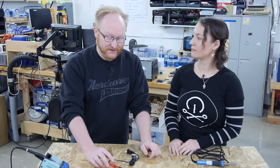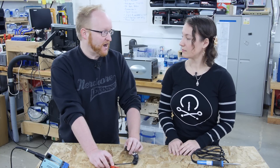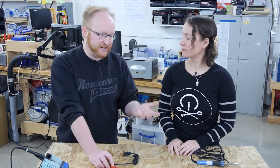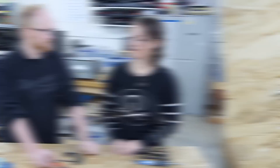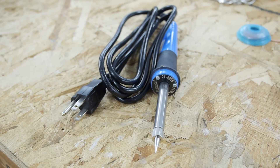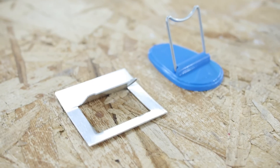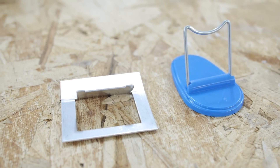The rule of thumb is that if a device has exposed metal, it's good for it to have a grounded plug, because that allows static to discharge into the earth instead of building up on your tool. As for why you'd want one of these cheaper soldering pencils — they're cheaper and smaller, so they're easier to store. They tend to come with little stands, which you want to make sure you're always using; don't set it on the table.